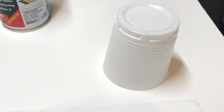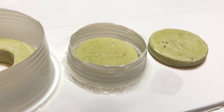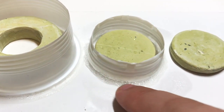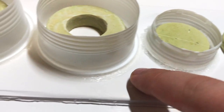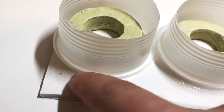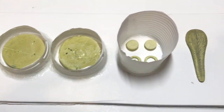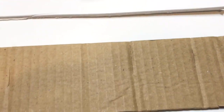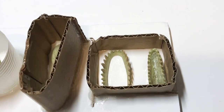I'm doing the exact same thing on all the other flat parts that can be glued onto a surface without affecting the cast at all. I went around and put more super glue around just to be sure that when we pour the silicon, it won't go anywhere else. I have used the plastic cups on everything that could be used with the cups. But for this part, I needed to make the walls out of cardboard, due to the size and shape.